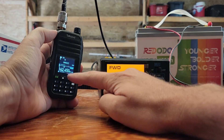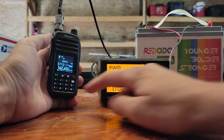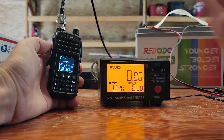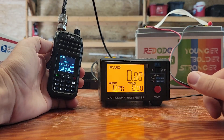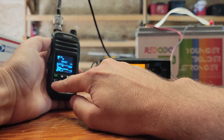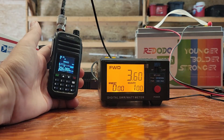On the bottom I'm at 162.450 MHz — that seems a lot like a weather channel, don't you think? Three watts out on the weather channel. Six and a half watts out on another setting. How about 224 MHz? 3.6 watts out.